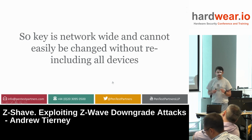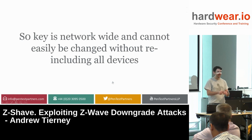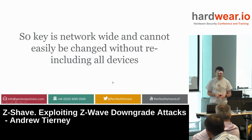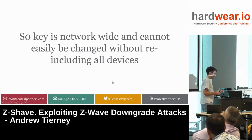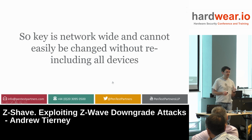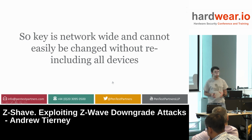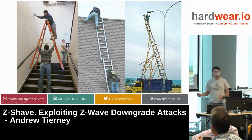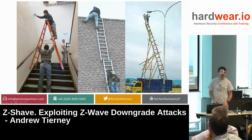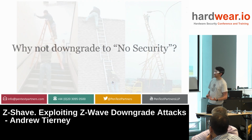Now, one of the problems is, once that S0 key's been compromised, I've got the S0 key for all of the devices in your house. Now, I looked at a poll on a forum for a home automation piece of software, and it seems that most people who put Z-Wave in their house have got more than 30 devices. Now, if you want to repair those devices and change the key on your network, for nearly all of them, you've got to manually go to that device and press a button on them. Now, that can be a bit of a problem. You know, if you're having to climb up ladders, remove switches from your walls, dig things up, it's going to be a problem. So changing those keys, it's not supported.